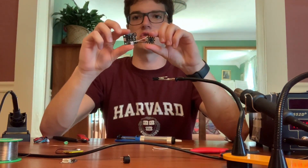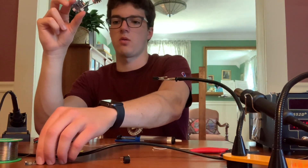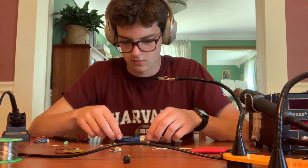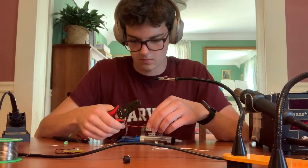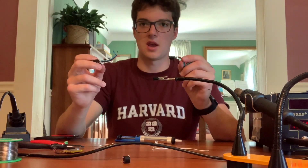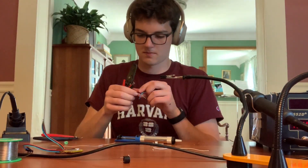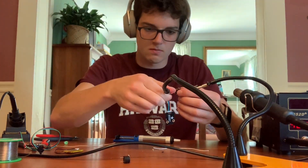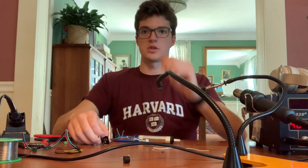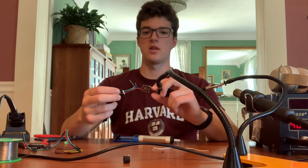Now I've got the LiPo controller connected to the microcontroller. The next step is to wire up the lightning sensor's power and ground pins to this little assembly. I took this cable and cut it because it was too much wire, and then stripped the four ends. The next thing is to wire the SCL and SDA lines to the SCL and SDA pads on the Beetle microcontroller.